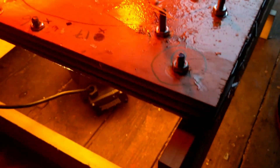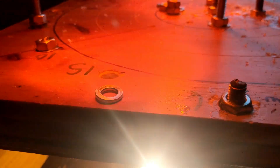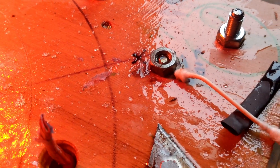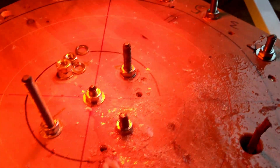This is a good idea though - having the stator on these legs so you can get underneath it and use a heat source to warm it up. I definitely recommend doing that - I'm going to make one. Obviously you would use a spirit level to make sure everything's level, and then use something underneath - maybe something not as aggressive as this - to heat it up. It's definitely doing the trick now. All this stuff just wasn't going hard and I thought maybe I didn't mix the second lot of hardener in well enough, but now I've applied some heat these lamps are brilliant and it seems to be doing the job.